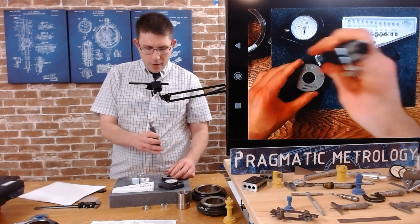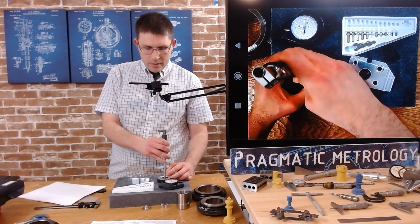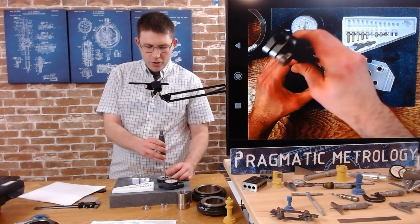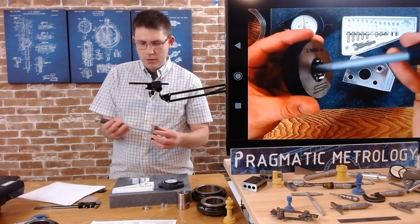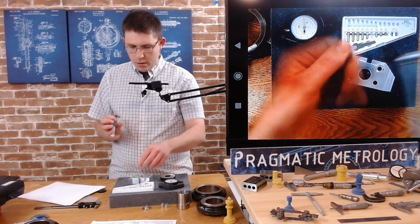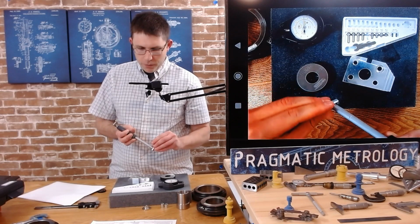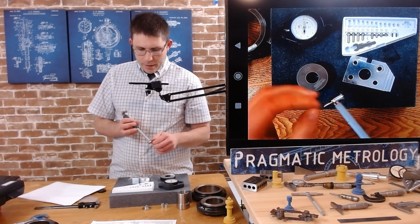So first of all, I'm just going to do a stroke check before I even attach the dial and see, it's too loose. I don't have enough engagement for the 1 inch. It's just floating through without engaging at all. So that one's too small. That's fine. We'll just move up one size. Now I'm grabbing the one that says 1.024 maximum, or I assume maximum, number 5. And we'll try that.